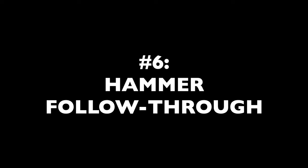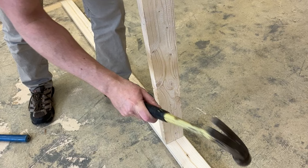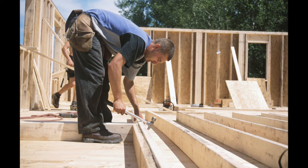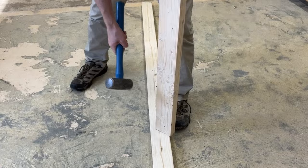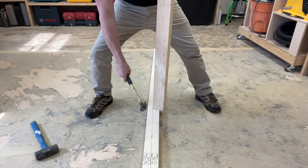Number six: hammer follow-through. Everyone knows you can bash a thumb or finger with a hammer, but most people don't realize you can bash a shin bone or kneecap just as easily. A lot of construction work requires swinging hammers below your waist — like when you're knocking old framing loose — meaning you end up swinging back towards your legs and feet very often. If you miss what you're aiming for, even slightly, you can bring the full force of the hammer directly into contact with your lower body. Even a 16-ounce hammer is heavy enough to break a bone, and things get even worse with a mini sledge, maul, or hatchet. Be aware of your leg placement while working and don't put your legs or feet in the direct path of the follow-through. Sometimes you have to stand like a doofus to avoid this, but it's better than smashing your own tibia.